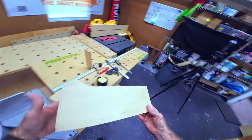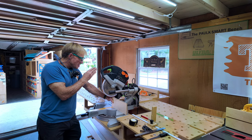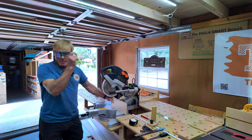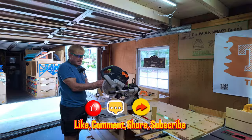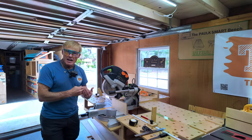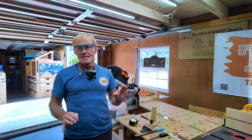The two-cut method. I'm going to take this board and cut it up against the fence. The saw is calibrated, so it's not going to help us — it's just going to be a nice parallel cut. I have dialed in one degree in the scale to the right. When I flip it around and cut it on the other side, we're going to have two degrees off. That's huge — we'll really be able to see it.